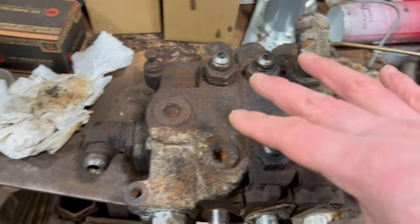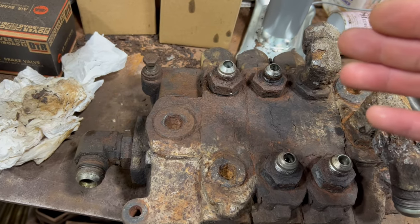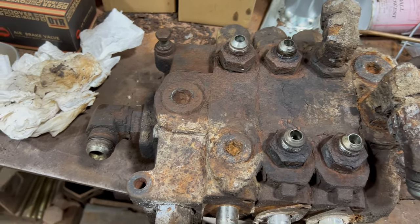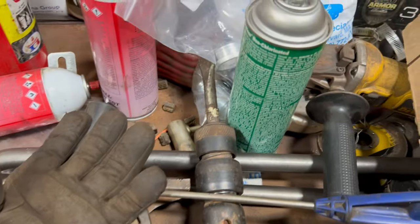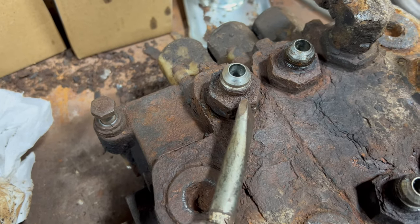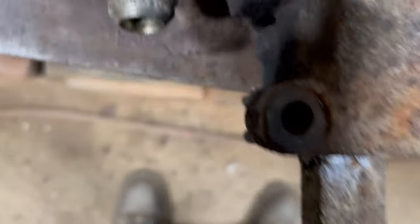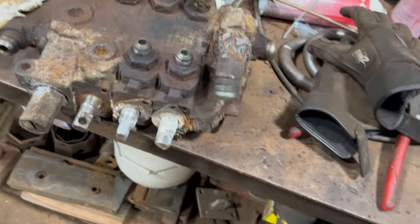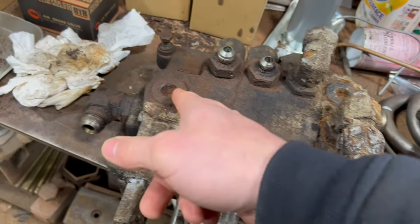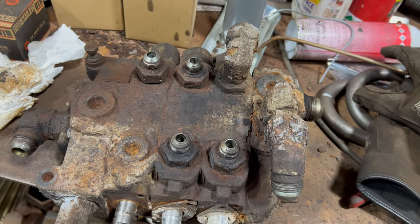All right, so I was pretty sure that these were O-ring boss fittings, but I just wanted to verify because I've got to go get all these. I didn't have the right wrench for these fittings, so I ended up just using the air hammer with a chisel bit on it. You just come in here like so and vibrate on it and get a little groove worn into it, and then you can turn it and hammer them out. That's how I got all these loose. You can see the little groove in them where I got them turning. They were all in there pretty tight. I got them all loose except for the plugs, but I just need that size plug. Hopefully they have them. So that's how I got the fittings out.